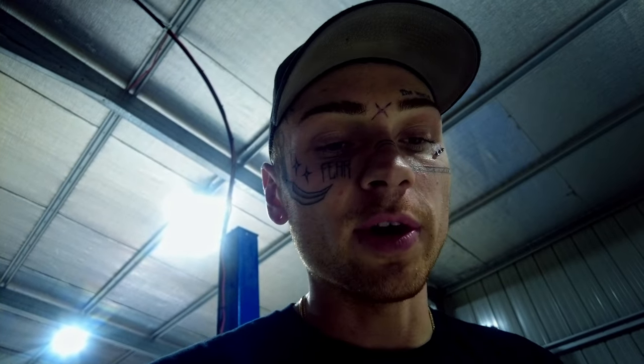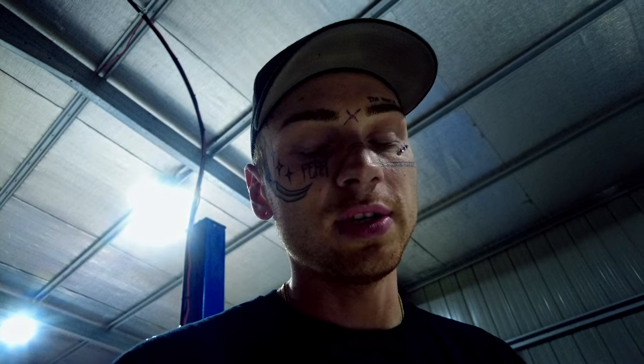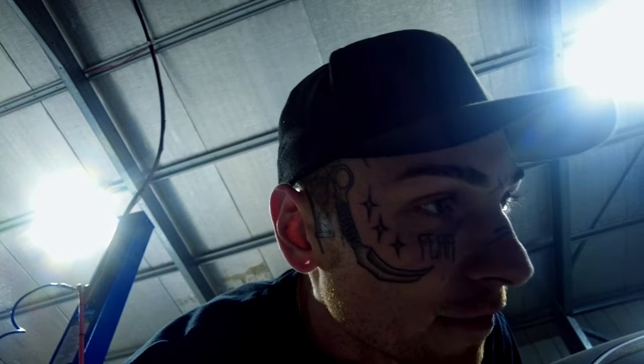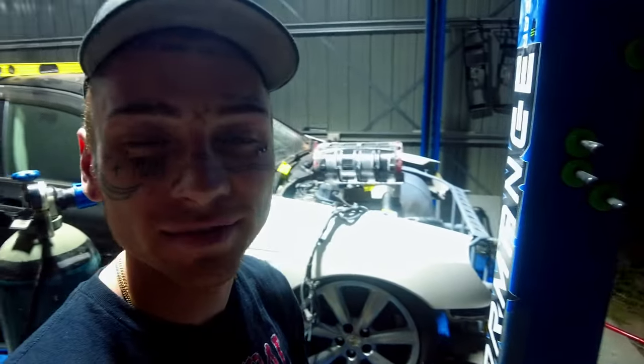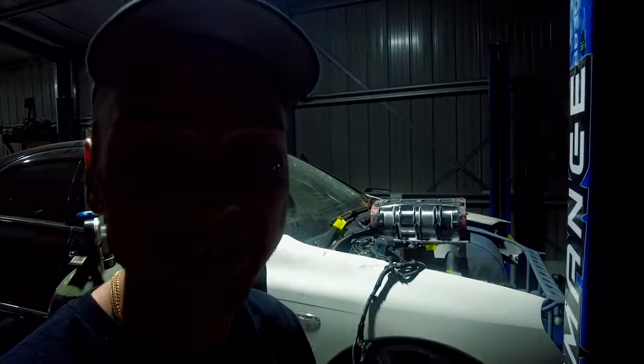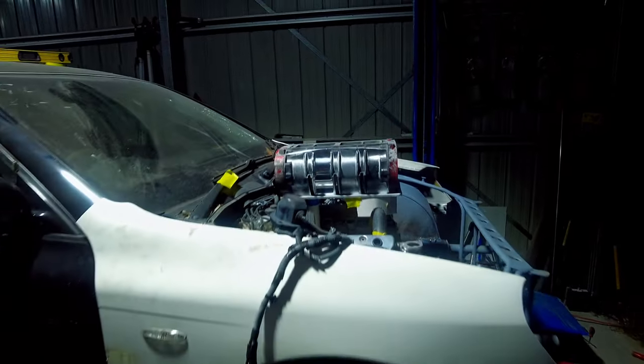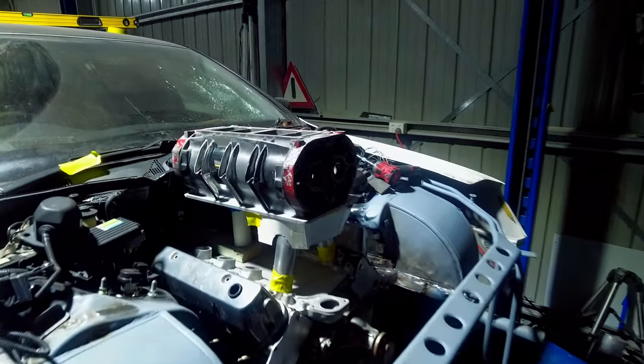What I did is I did a quick brush through the grit to get it to a point where I can get some shine out of it with just a hand polish, and I'm going to see just how obvious the porosity is. If it's real dog shit I'm probably not going to continue polishing it because there's nothing I can do about it. I've gone pretty deep already so it's not an issue of not being deep enough through the material to get it flat.